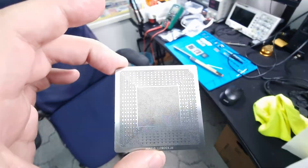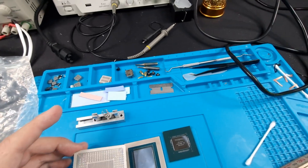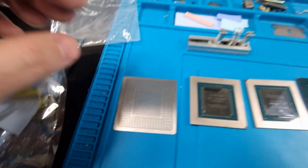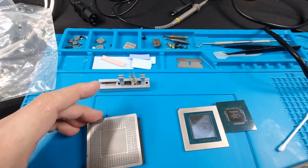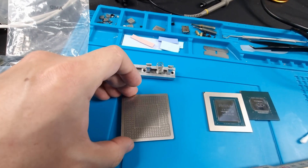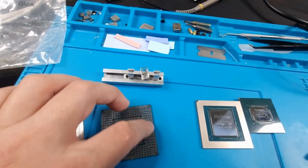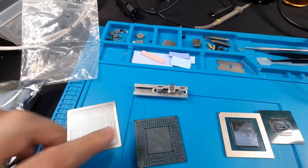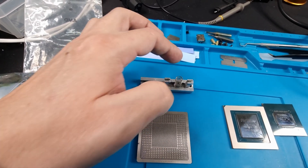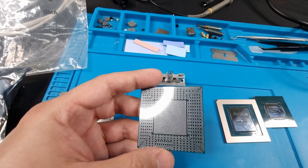This is the way that I do it. These are my stencils — those are for 90 by 90 so they're not direct heat. This is a direct heat stencil and you have to keep these things immaculately clean. Basically the stencil just goes on here — I already managed to scuff it a little bit. The stencil goes on here with the chip underneath, then you apply heat. You have to use some flux — just smear it a little bit, put the stencil on, let the balls fall into place, add heat, then remove the stencil. Easy peasy — same way I do my memory reballs.